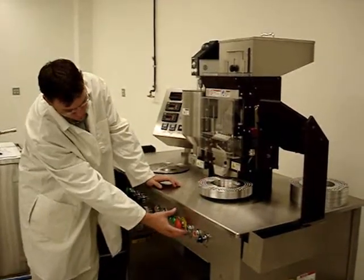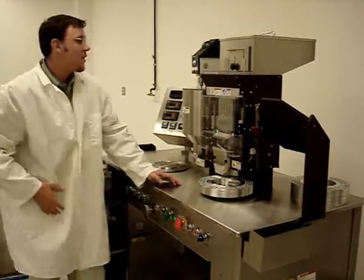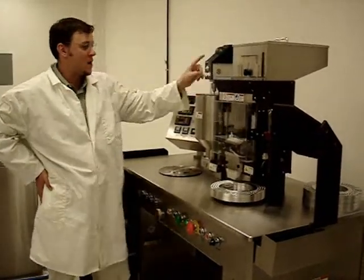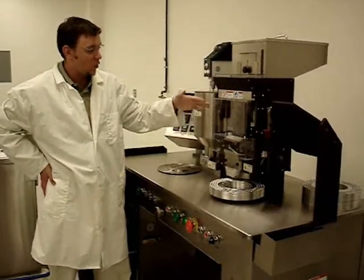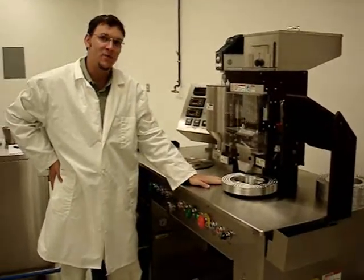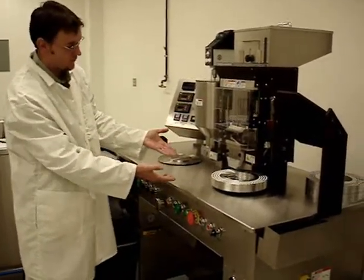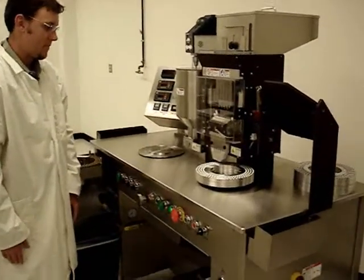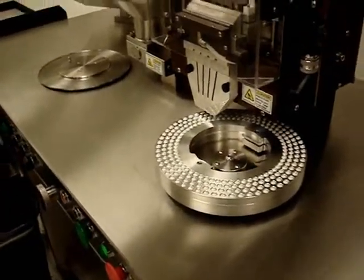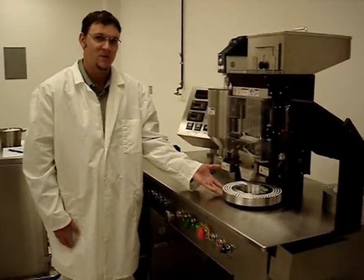Press the green button for rectifier start. The empty capsules are put into the hopper before you start this process. From here they go through the rectifier, orientated body down, cap up. Underneath the ring there is a vacuum which separates the body from the cap within the ring. Now we have a size 00 ring filled with empty capsules — this is the rectification.